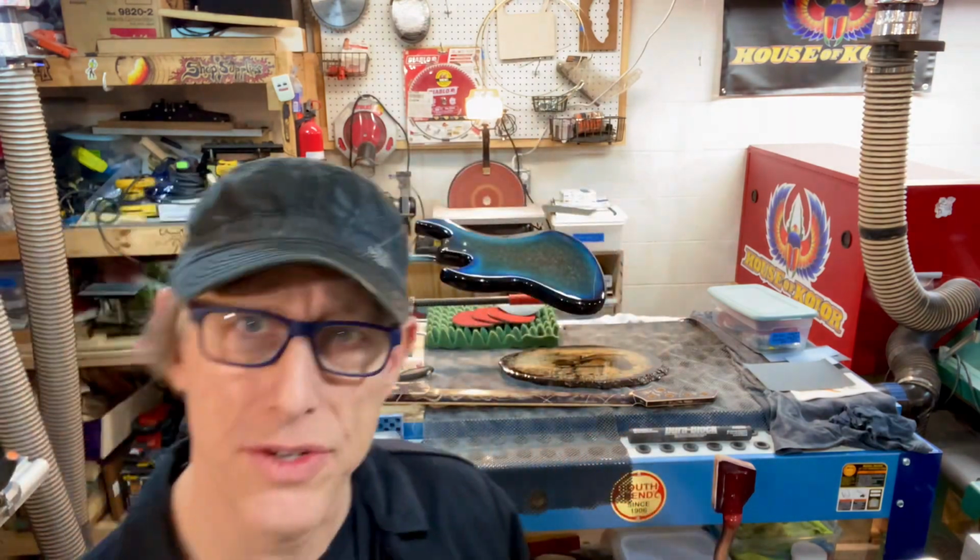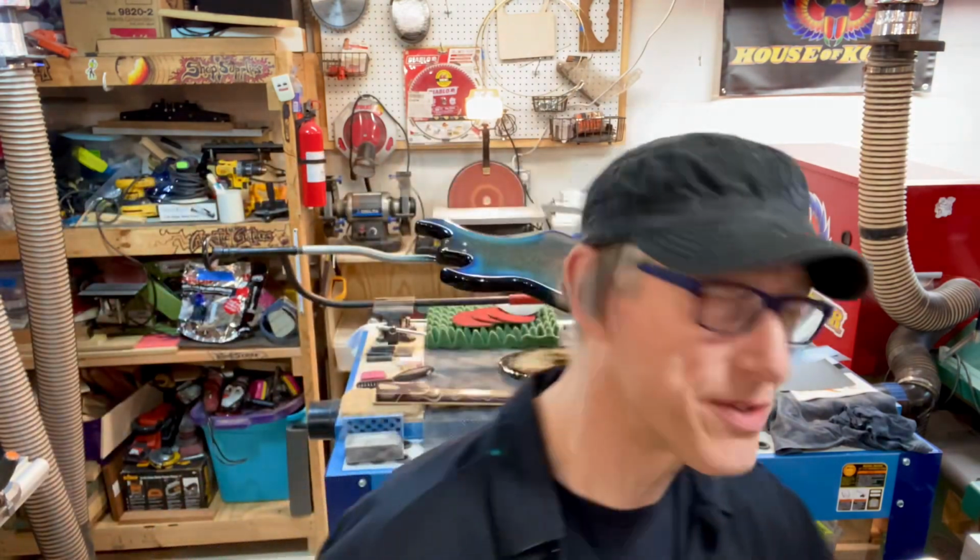After we got it pretty well squared away, we did spray it with a polyester sealer and pore filler, so we could put a mid carrier coat on to do some effects, which we had done on this. I wanted to experiment with that. I'm not sure we're going to do any color or candies over the forged carbon fiber for the next bass, the Spectre bass. But I just wanted to try it, and this is a gift, so you don't have a choice. If you want to try something, you're going to get it.